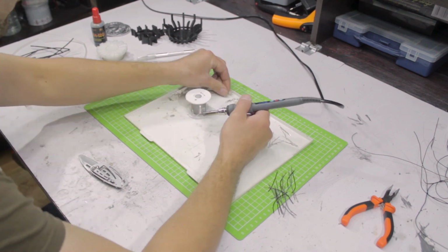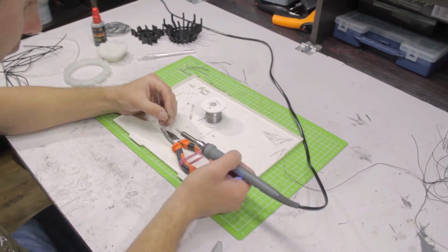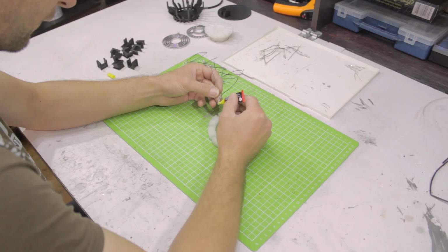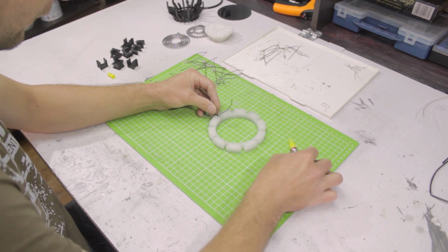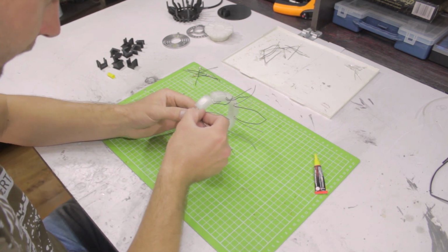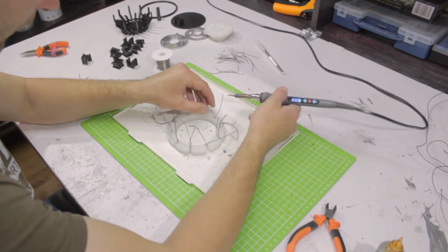By the way, I had to push as many as 40 LEDs into this model, so that everything would glow as it should. We connect the LEDs in pairs, solder the wires to them and install in the outer ring. Here we have 10 pairs of LEDs. I remind you that the power supply is 12 volts. I made 2 circuits, 4 pairs in each, and connected the remaining 2 pairs in series.